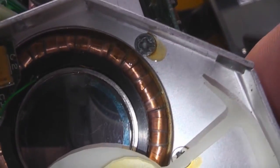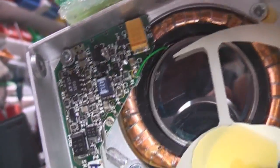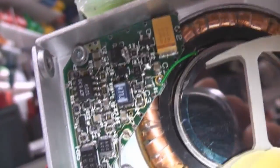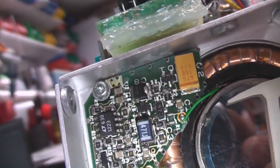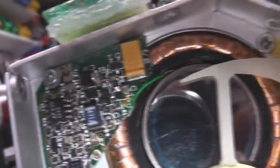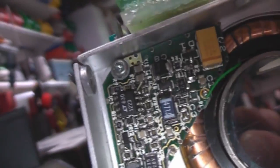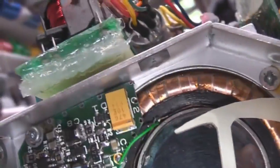This is the front of the tube. I think this copper stuff is probably shielding around the scanning coils. These tubes, assuming they're similar to standard Vidicon tubes, are electromagnetically scanned, so there'll be a set of scan coils around there to generate the beam sweep across the face of the tube. Up here this is the amplifier for the signal. The thing about Vidicon tubes is they output a fairly high frequency signal at high impedance, so the amplifier has to be very close to the front because any stray capacitance will just completely kill the signal. If you look at an old Vidicon video camera you'll see exactly the same thing - the front end amplifier is right next to the front target connection. There's a connection from this front ring which is connected to the face of the tube.